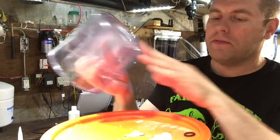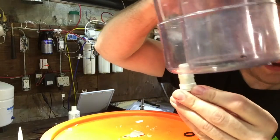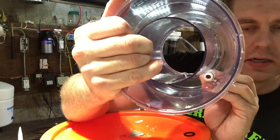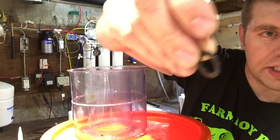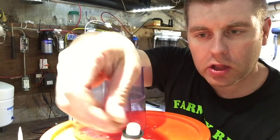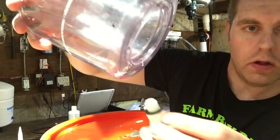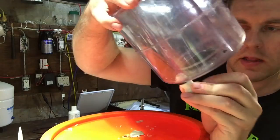Let's try the fitting and see if it's the right size. Blow away all the debris — look at that, it's fitting in the inside. You can see on the inside that's where we're going to put our connector. What also comes with the fitting is a rubber seal, like the ones you get for a faucet on your sink. That'll go on before the nut, right in the hole like this to make a tight seal.